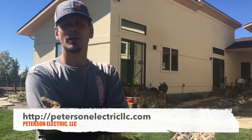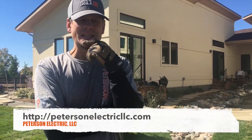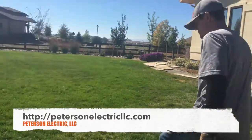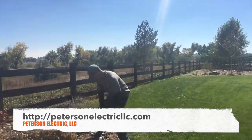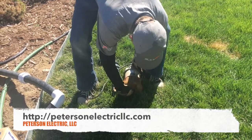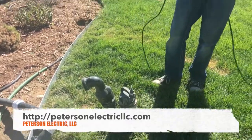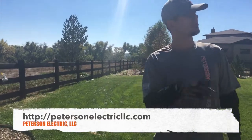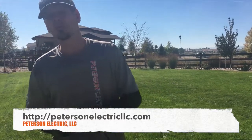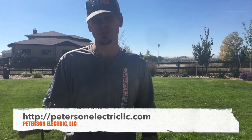Over the phone, just because I knew them and was trying to help her out, I told her to isolate the pond pump, pull it out, clean it with the hose, take it inside, fill up your tub, put down a rubber mat or garden mat so you don't scratch it, and put the pond pump in — it's a large pump. Then the water will suck in and push out. Have her plug it into the GFCI in the bathroom. In this brand-new house the bathrooms were separated — there are five bathrooms — so I didn't have to worry about extra load from a 1950s house. She plugged it in and it popped that circuit.